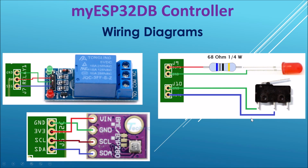Just to show you how you would connect, for example, switches as input devices, and how you would connect LEDs as output devices. In this particular case, this LED doesn't have a built-in resistor. It's just a standard LED, so you can't really provide 5 volts directly to it. You have to use a current limiting resistor to ensure that it doesn't draw more than 20 milliamps.